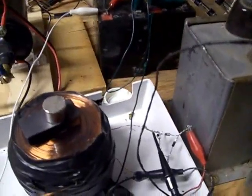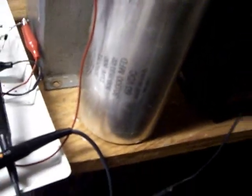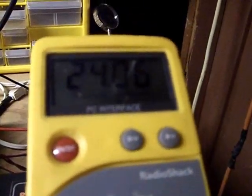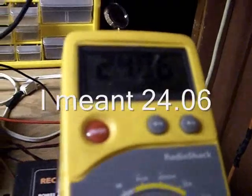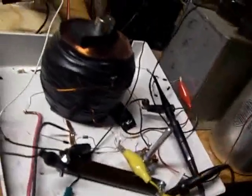I got it running on a 24 volt battery bank and I have the recovery winding charging this cap right here. I changed to a bigger cap — a 30,000 microfarad 60 volt cap — and right now the battery voltage is at 24.06. This inductive heating element is not really that warm but I'm using very low power right now. I'm going to change the frequency and show what the input and output actually look like on this particular circuit.